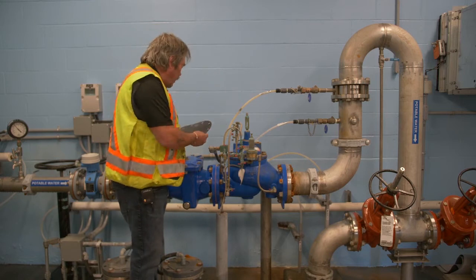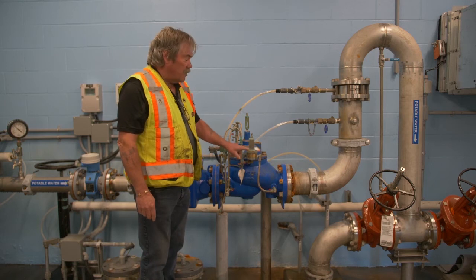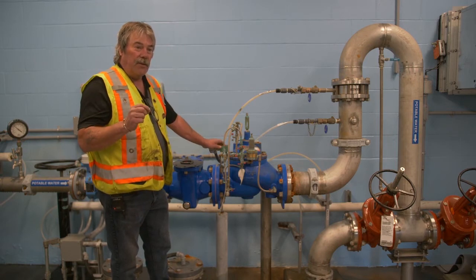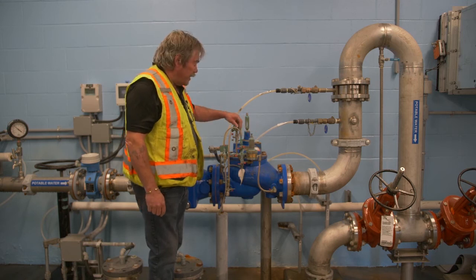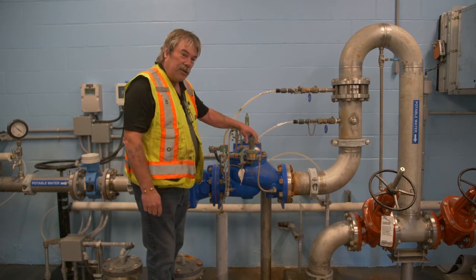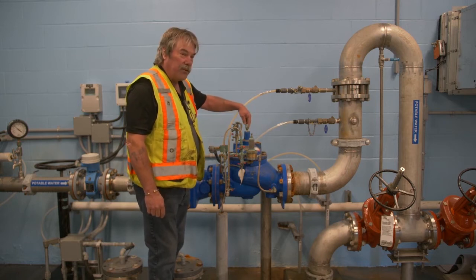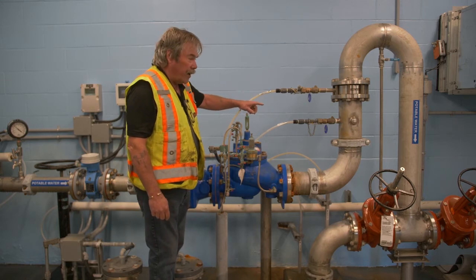These aren't really the problem very often, but they can be. It's this guy here that creates all the problems. There's a really thin little gasket in there — it's the same looking diaphragm as this one, only way smaller and very, very thin, and this is the one that controls your pressure. It seeks pressure from this side of the valve to that side of the valve, and when it sees that this pressure is less than the other side, it'll increase the flow coming through to domestic water going out to the system.